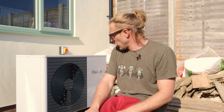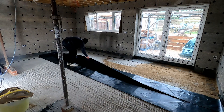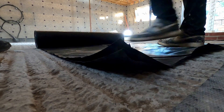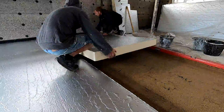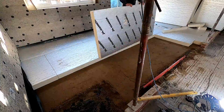We actually started with the underfloor heating inside the house back in winter of last year — it's now summer the following year, so a fair few months have passed. We started with the underfloor heating and layered it up by beginning with a membrane on top of the concrete raft foundation, then layered sand on top of that, followed by 150 millimetres of rigid floor insulation.